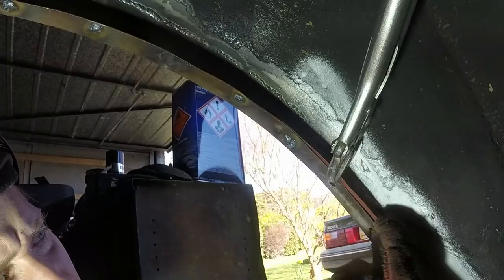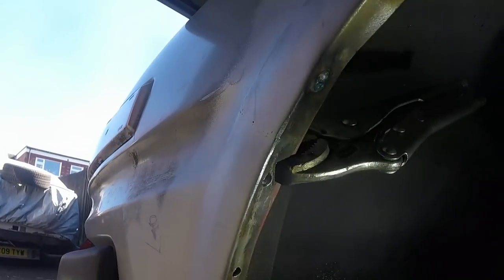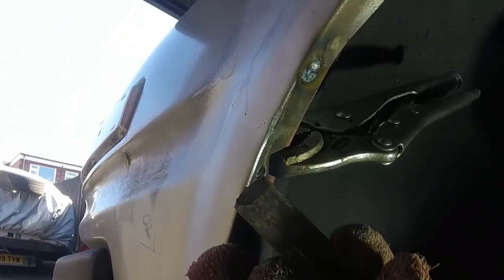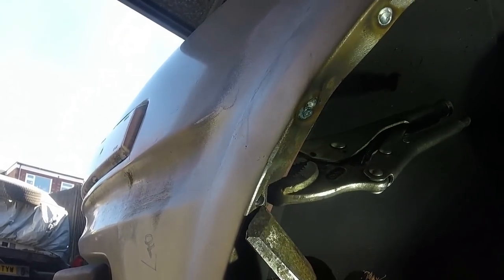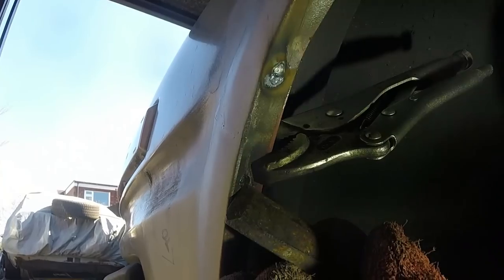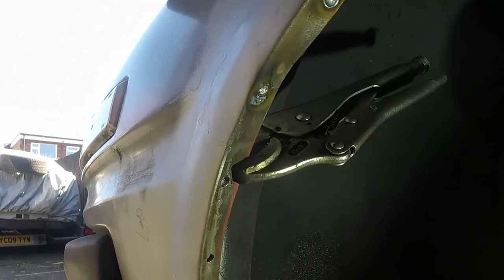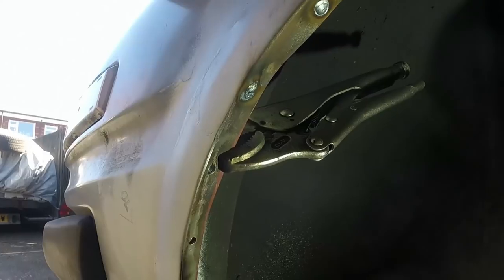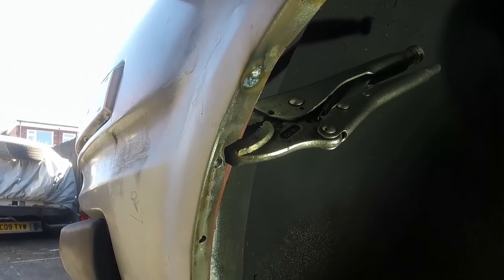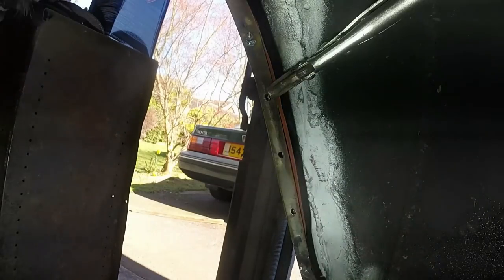So that one again, I've accidentally managed to drill all the way through. What I'm going to try and do is, can you see? You can see there's a shoulder. You've got the panel on the top here, and then inboard of that, you've got the panel behind, and then you've got the big flapper. I don't want to disturb the flapper because I'm hoping that will stop any sort of hedgehog spikes going through. What I'm going to do is weld in from this side with lower power, but because I have got an end to weld into, it'll penetrate nicely. So I'm going to hold the gun over here and go in that way and then gradually fill it up. And even though it's not ideal, I'm pretty sure even with lower power, because of the way that hole is now configured, I'll get good penetration.